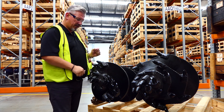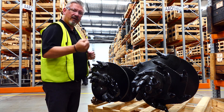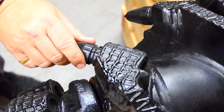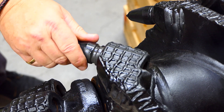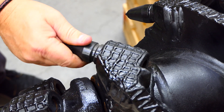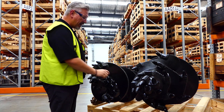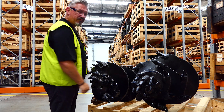Check your teeth and make sure they're all rotating. Have a dead blow hammer or a copper hammer — give them a hit to make sure they're rotating. Be careful not to touch them with your fingers because they're going to be extremely hot and you'll burn yourself. With a pair of gloves, give them a turn and make sure they're rotating.